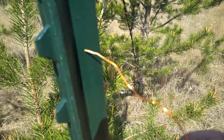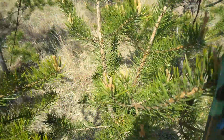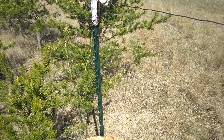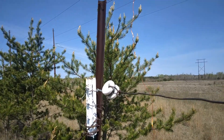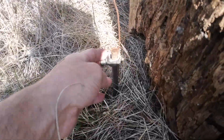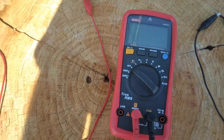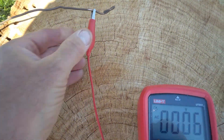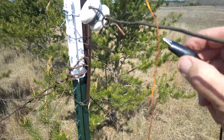You can hear it's got a pretty good charge on it — going right through the paint. The bottom wire is probably about five, five and a half feet off the ground, and the top wire is about eight inches higher. The first thing I'm going to do is just test the voltages on these wires. I have a ground rod pounded in about three feet, with wire attached. I've got my high voltage meter and I'll set that to 2,000 volts.